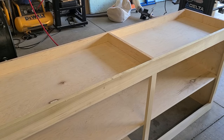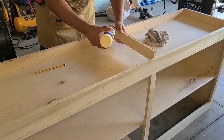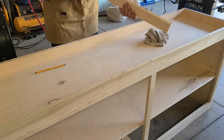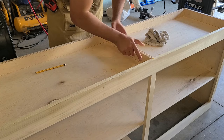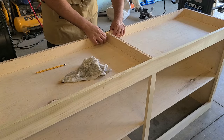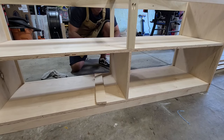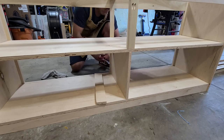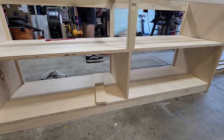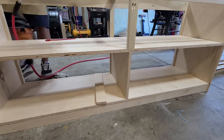On the underside I'm using some support pieces cut out of scrap three-quarter inch plywood on the very back edge and the center piece so it's more stable once it's all built up. After those bottom extra supports dried, I added a cleat or upright support and also added that vertical divider — I'm centering it and then just gluing and shooting it in.